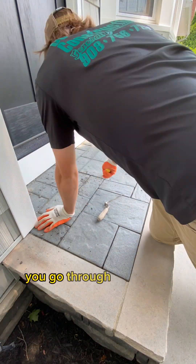We're literally just trying to touch up all the polymeric sand. We get it in there and beat it down over and over again. Now we leave the layer of polymeric sand on top for two reasons: one, so that it can get back down in; and two, so we're not directly beating these old pavers, because we don't want to crack them.